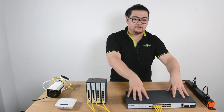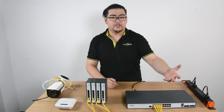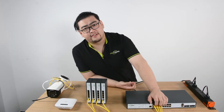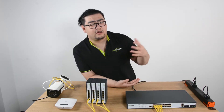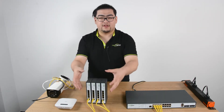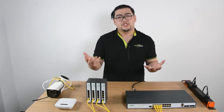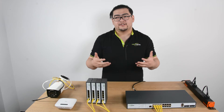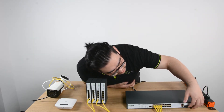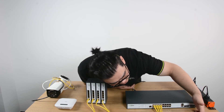So the two main parts are the 16-port PoE switch and the 4-port PoE-powered switches. Looking at the 16-port PoE switch, it has 16 ports. Of those, 8 are high-powered ports — they output a large amount of power to support the powered switches and their IP devices. The other 8 are regular PoE ports for closer devices that don't require as much power. We also have a few fiber-optic pluggables here for connecting fiber-optic cables for longer transmissions.